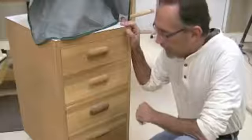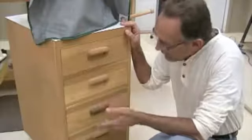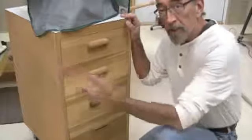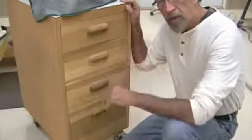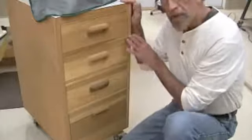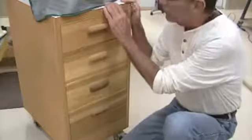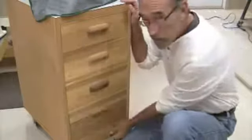I wheeled this over just to give you an idea of the basic construction techniques I use to build cabinets in the down-to-earth woodworking shop. This is pretty typical - this happens to be the cabinet my mortising machine is sitting on. Basically I do the same thing every time: I build a basic carcass with three-quarter inch cabinet grade plywood using dado construction throughout. I cut sides first to size, figure out where the dados need to be, and run those with a router. Because of the weight of the mortising machine, I put two pieces of three-quarter inch ply on the top, both set into dados.